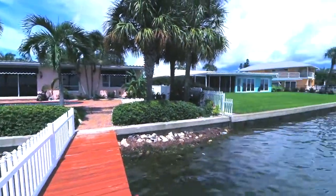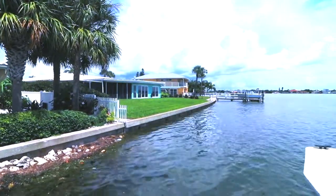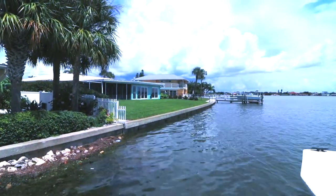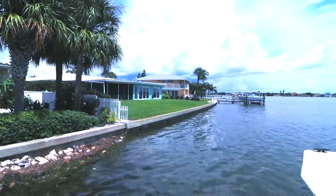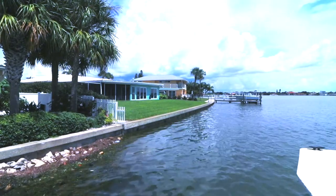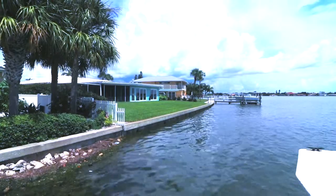Over on this wall you can see those black squares. Those are actually the dead men that are going back into the yard. Those help hold the wall up, and those look in good shape. Those were probably an addition after the wall was put in, maybe in the last 10 years or so, to just reinforce that wall without having to put a new one in.